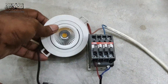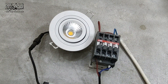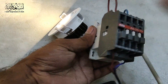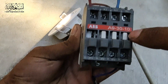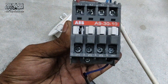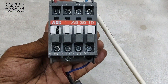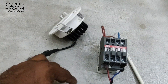Now if we give the supply — for example I just turn on the supply. If I turn on, you can see the contactor. If I move the light here you can see that these contact points go inside because the magnet pulls them. If I turn off, the points will come out. If I turn on, the magnet will go down; if I turn off, the magnet will come out. That is the main work of the contactor.